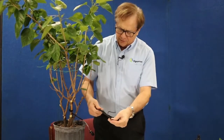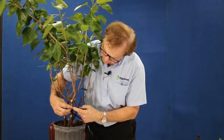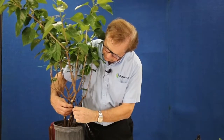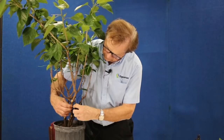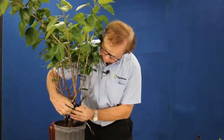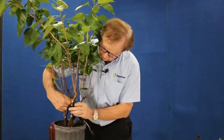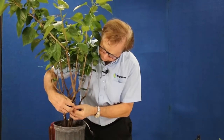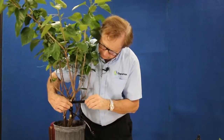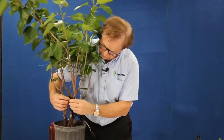The very next step is I use the stretch Velcro and I'll wrap it around the stem. I'll start right here at this Velcro, and I'll stretch it to give a little security to securing the heater to the stem. And then as I wrap around it, I'll stretch it a little bit more, and then I'll be securing the upper thermocouples directly to the stem. Each time I pull on it, I'm stretching it about 20% or so. Not too strong, but just enough to keep the sensor from moving around.